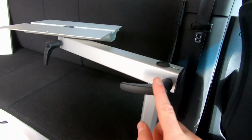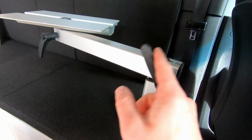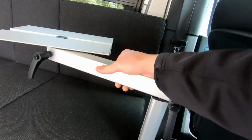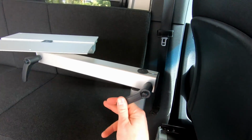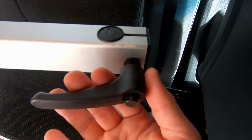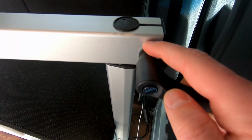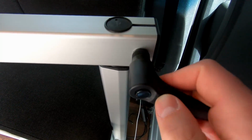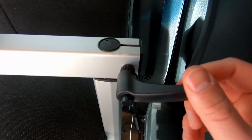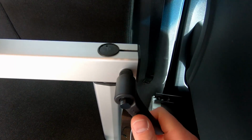Okay, so all 3 of these swivels right here work the exact same way. Essentially, they swivel and unscrew, loosening the bracket so that that mounting point can be attached or reattached. And then if you make it semi-tight like it is right now, it swivels, but it doesn't come off very easily. One cool feature on these little swivels is you can pull the bracket out and it doesn't engage the rotation of the bolt. So when I'm pulling it out, it's not tightening or loosening it. It's only when I let the handle retract back in that it's actually tightening down the piece.